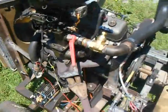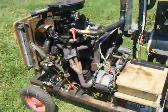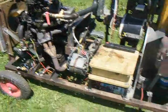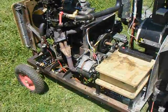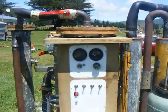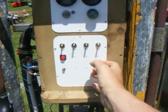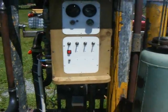The engine has run quite nicely on this setup. I'm able to get about 4,000 RPM out of it, and under load — up to 4,800 watts — the speed drops off to around 3,500 RPM, according to my high-technology control panel here.